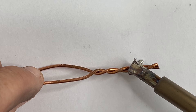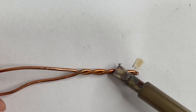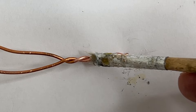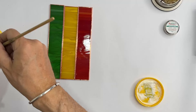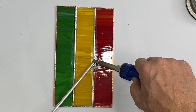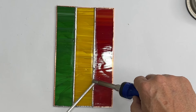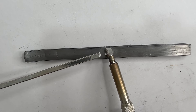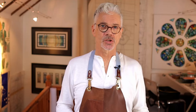As you can see here, the solder is not adhering to the copper at all — it's simply sitting on the surface and not bonding in any way. When we apply flux, you can see the copper is immediately cleaning itself up; it's much brighter, getting rid of the oxidization which allows the solder to bond really well with the copper foil and with lead. Applying flux to your joints allows you to get a really nice bonding connection. With lead, applying a paste flux and holding the soldering iron for a couple of seconds gives you a lovely flat button solder joint.